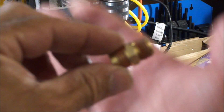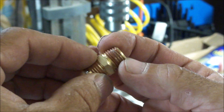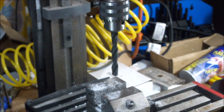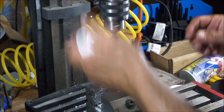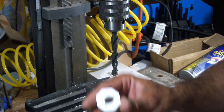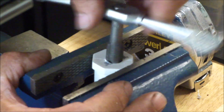This is the insert we'll be using — it's a common air fitting and you can find it at Lowe's or Home Depot. A half-inch drill will give me enough meat left on the plastic to get this threaded in there, so I've got a half-inch drill bit on the press. Got a nice hole drilled in there — there's about a quarter inch of meat. This tap is slightly smaller for the half-inch, but it is getting in there and giving me a start of a thread.